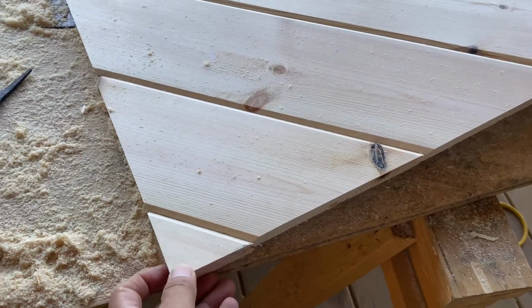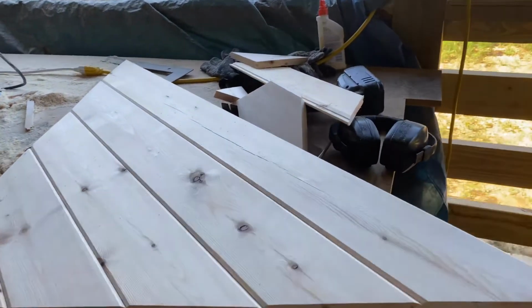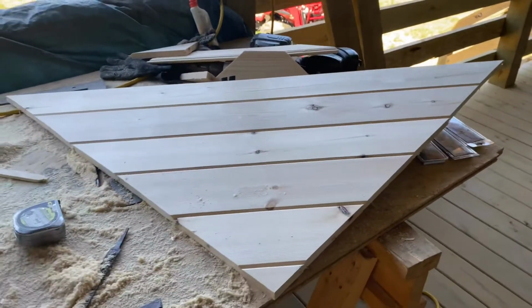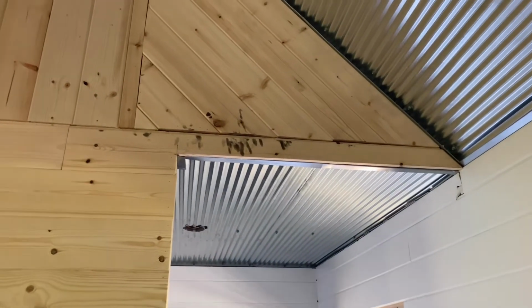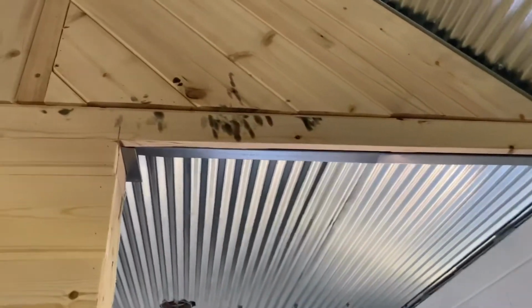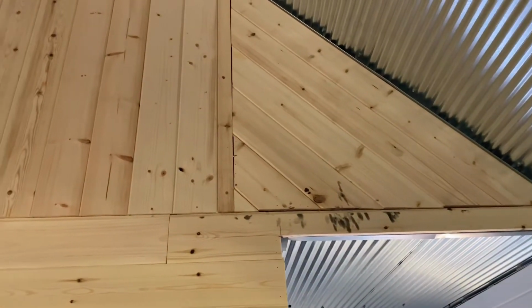Now, like I said, this is not normally a how-to YouTube channel because I don't feel like I have enough experience to really be telling anybody about carpentry especially. But if you are a do-it-yourselfer like myself, if you're going to do these corners, and I'm sure there's a name for it, but I don't know what it is, maybe consider putting all the pieces together first, because I'll tell you what it's going to alleviate. I'll just take that in there and install it into that corner. What it's going to alleviate is having to get those weird cut pieces into a tight space. And first of all, those rubber mallet marks are going to be covered up with paint. We'll sand them off some and then of course they'll be painted. But pre-cutting them will alleviate having to force that into the space. So I just thought I would share that.